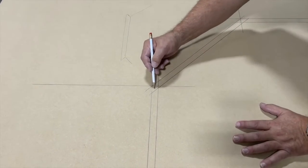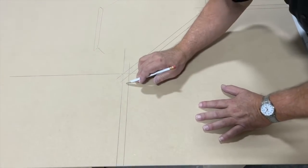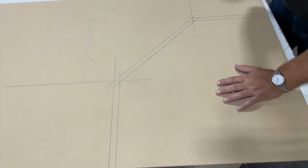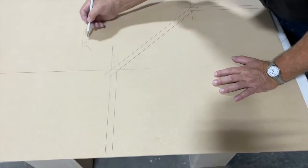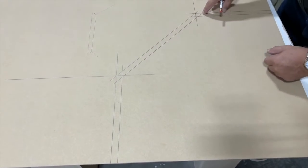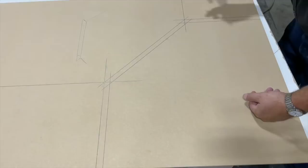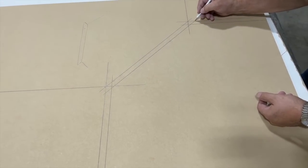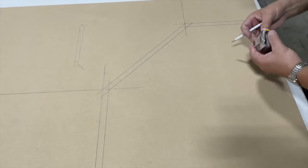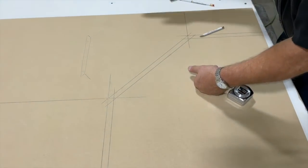So our solid face frame is through this line right here. And this is our end panel starting at this point going back. Now, I always make a face frame, and so our face frame will have stiles and rails. The stiles, I have determined over the course of years that the stiles need to be 2 3/16 from this point over. And the reason is when we get a door on here, the door needs to open.